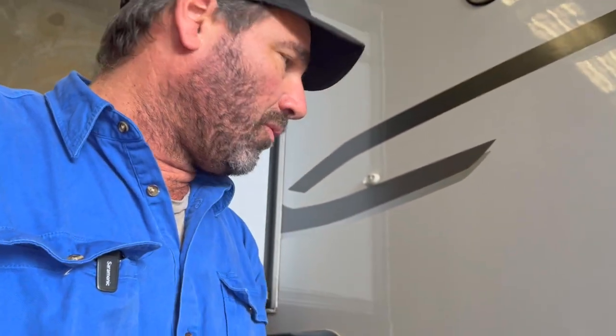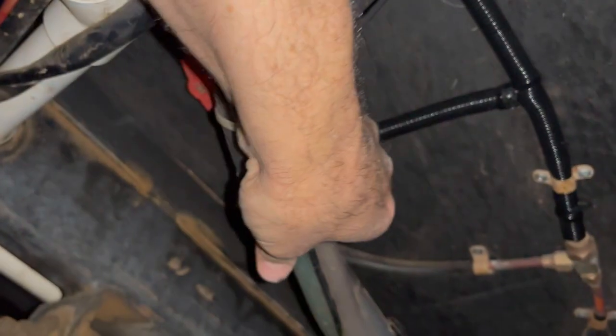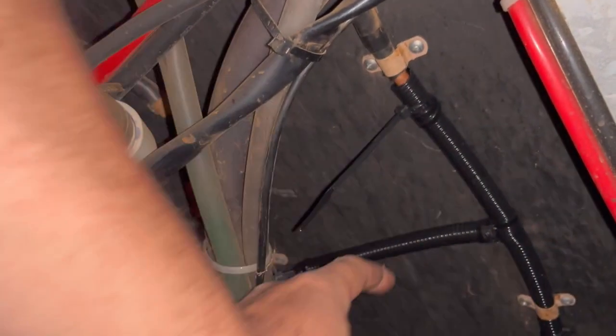So this is the harder part that was quite difficult. Why was it so hard? The SilverLine is, I think, the top of the range Jayco van. It's got all the bells and whistles inside and also outside and mostly underneath - that's the problem. They've got water tanks and grey water tanks and lines running everywhere. It's a road van, but it's got trailing arm suspension and stuff like that. Underneath, this is one of the water tanks, and then all the suspension, all the T's and copper and everything - this is where the existing line was. So I had to weld a T in next to the plastic water tank and all this cabling had to be protected.